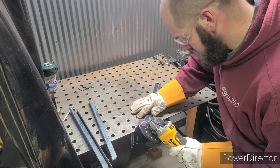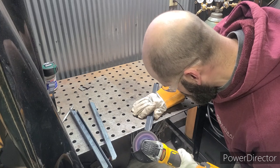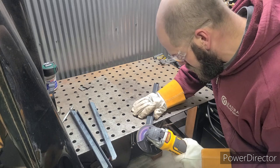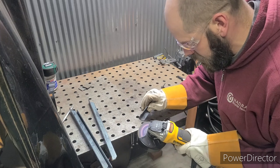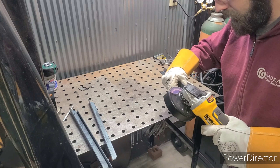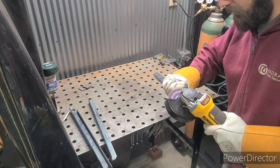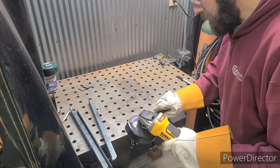While I was cutting the braces for these slats, I also put some 45-degree cuts on the corners of the angle iron. I did this so I could go through and round off those corners and take all the burrs off. This way, in case my cat goes under my chair or someone brushes up against the back, they're not going to catch a sharp edge on anything — everything will be nice and smooth.